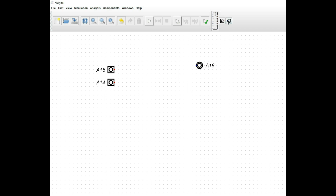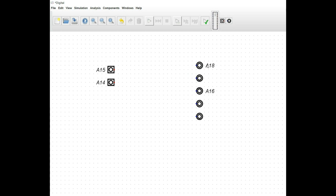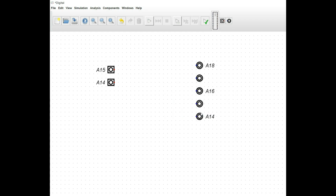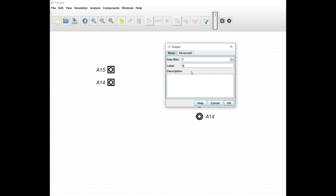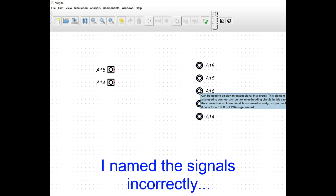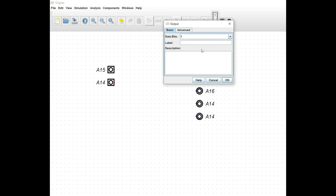But something else that we haven't thought about is that we are going to need a few extras. It's not just the 3 that we need here, which is going to be A16, A17, and A18. We're also going to need to replace A14 and A15. So that tells us that we are going to need a system that gives us at least 5 bits on each latch. But more importantly, we also need to be able to distinguish between ROM and RAM.